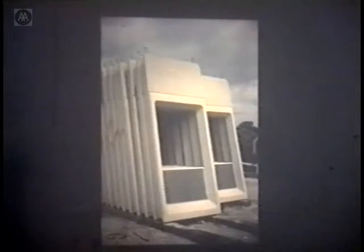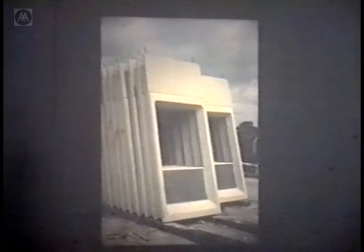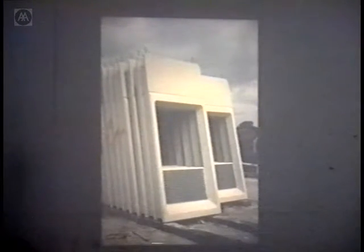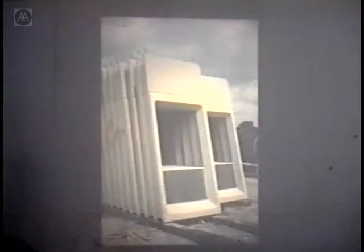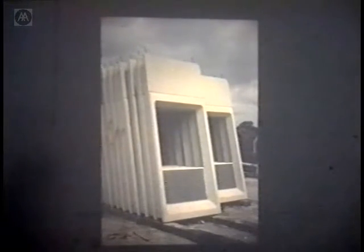Precast also has the advantage that you can quite easily do different finishes in different parts of the panel. These were cast face downwards to produce the shape, the framework parts and the fluted parts at the top and the reverse. But the troweled surface is the top of the thing as cast, and that doesn't require a great deal of skill because it's not going to be seen as the final finish.